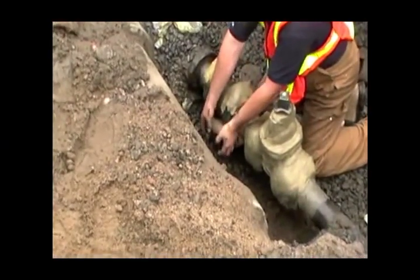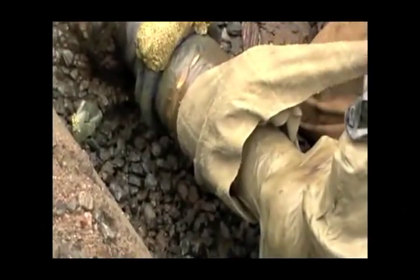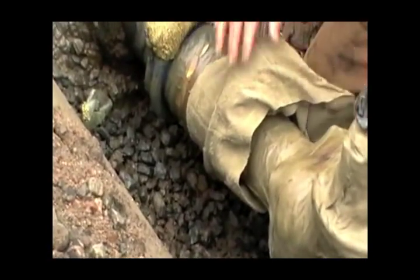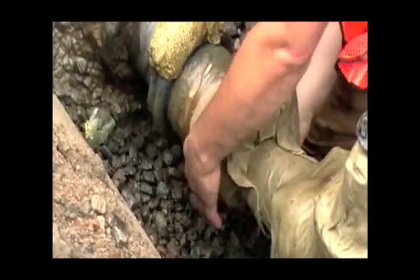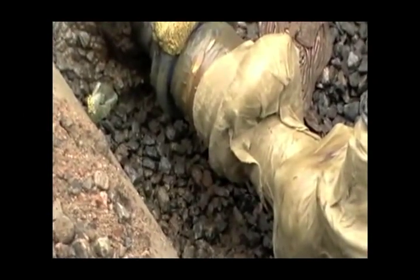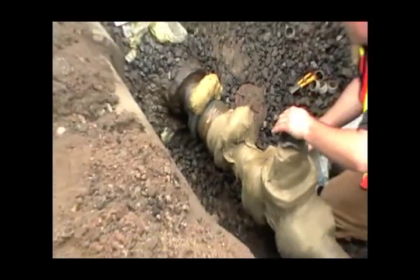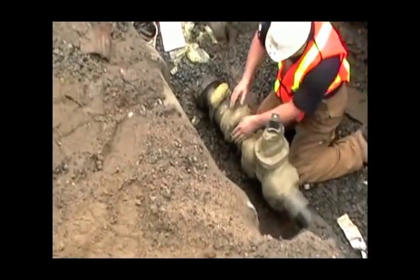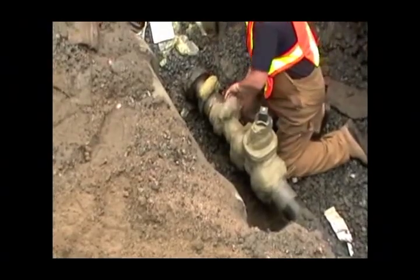For example, if you had an area with very limited space, you can actually take the tape, and like I said, we make this from 2 inches right up to 12 inches wide. You can take a wider tape, cut a section off on a piece of plywood or cardboard, and you have very minimal area to get around. You can slide that tape on the piece of cardboard underneath it, lift it off, and go around in that fashion. So you have that option for really confined, tight spaces.